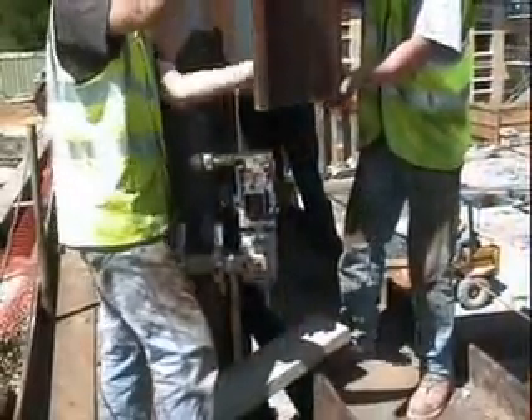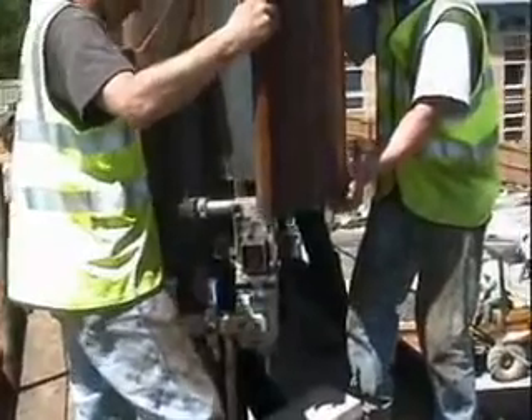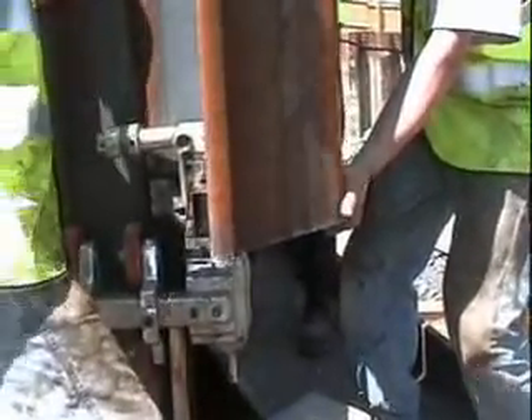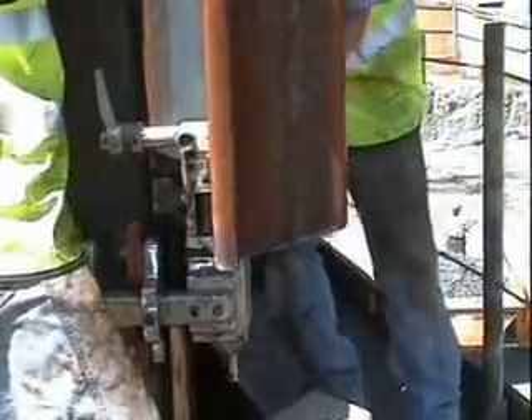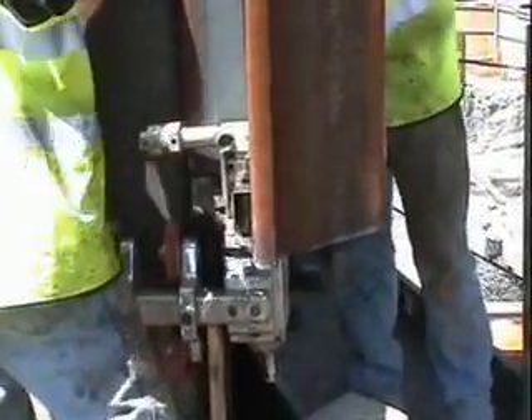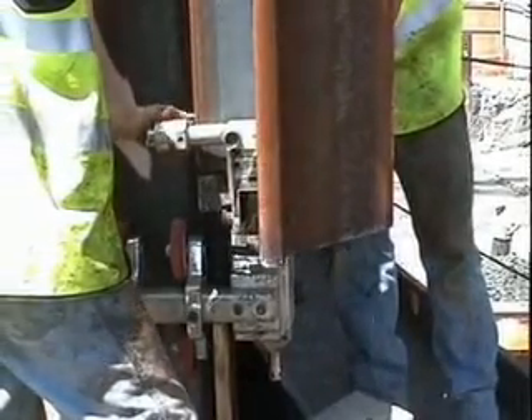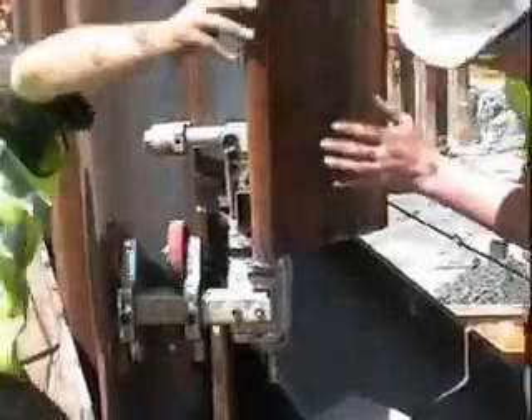The pile to be pitched is gently lowered into the vice block and pushed into light contact with the vice stop. The vice screw is then fully tightened. It is good practice to swing the vice stop out of the way to prevent damage.